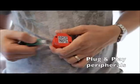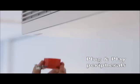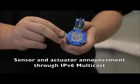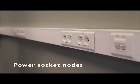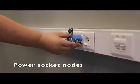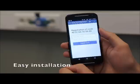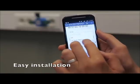When you plug a sensor into your Micro Plug and Play mote, it is instantly identified based on 4 resistor values. From these resistor values, we join an appropriate multicast group, for example, light, temperature, or humidity. Installing Micro Plug and Play nodes is a snap. Simply scan the QR code, name your mote, and identify its location.